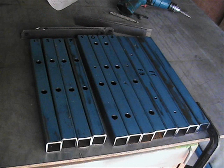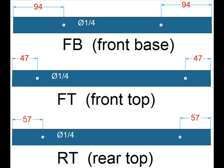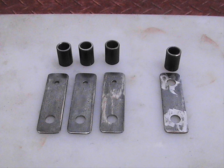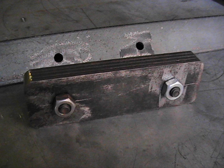The reason for the different size bolt holes will become apparent as we proceed through. As well as the 8 upright posts, there are 4 horizontal braces also made from 30mm tube. Three of these have quarter inch holes drilled at various locations and are marked with initials to show their location on the frame. The 4th horizontal brace has no holes in it. You now have all the parts you need to make up the basic frame, but you will also at this stage need to make up the parts for the belt actuator trunnion mountings. For the time being, just cut and drill out the parts as shown in the diagram, but do not weld the parts together just yet. You will need to bore out the pipe sections to take a 5/8 shaft. I also recommend that you use your drilling jig to get the precise centres for the holes in the mounting plate.